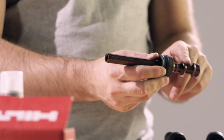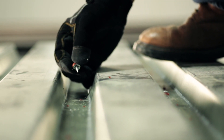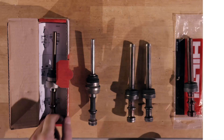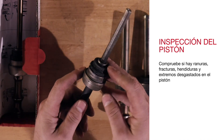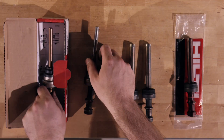The piston and brake or stop need to be inspected, cleaned, and replaced regularly. Factors such as missing the joist or beam, cartridge selection, and cleaning frequency can drastically reduce piston life. The piston and brake for the DX9 HSN is smaller. If the rubber on the brake is worn, or if there is excessive wear on the piston or chips at the end, replace it with a new piston and brake assembly.